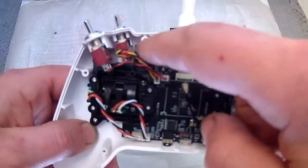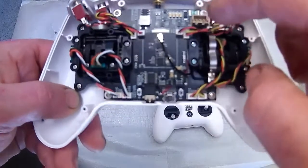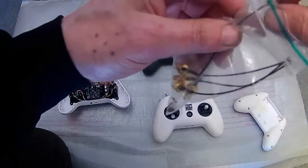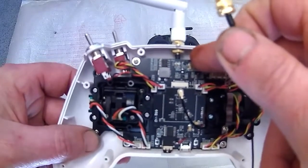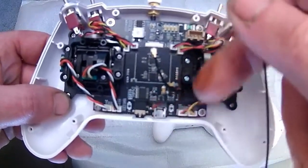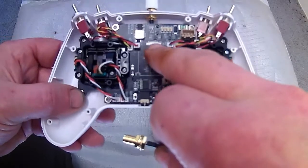You're going to have to take four screws off the board — one there, one there, and one there. You don't have to take the gimbals off, just undo these four and the plate will move. You don't need to unplug the wires — at least I didn't. The threaded end of the connector is quite long, so you can't get it through the hole without removing that board, but the board will move enough without taking it completely off. Just lift it up and slide it back slightly. Then run the wire underneath both boards and back up, and it's just a push fit onto the connector section.